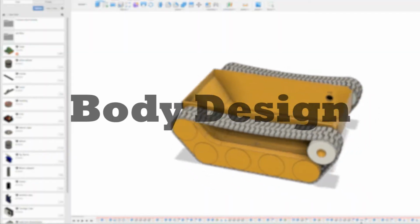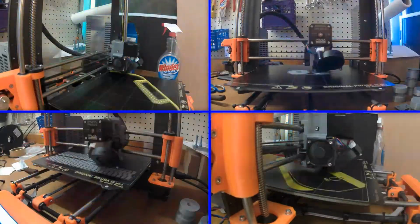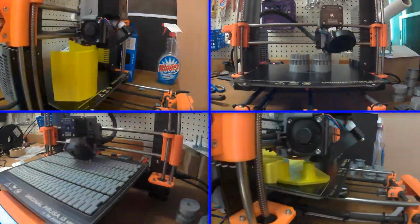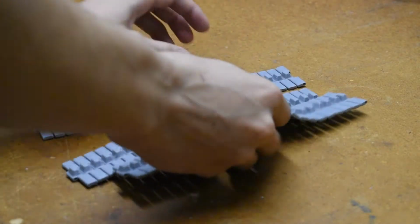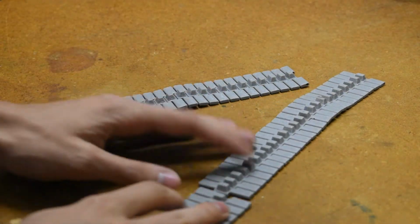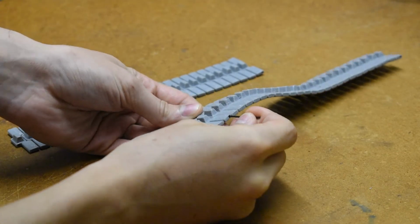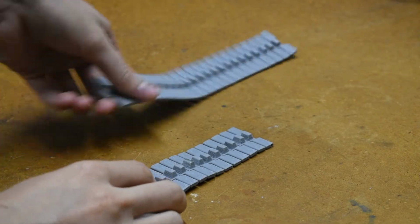Now that the software was working, we're also going to skip over the many iterations of wheels and tracks that were required to get the tank to where it is now, and start the assembly of the base of the tank. My original idea of using wheels had to change because after many tests, the wheel axles eventually all broke because of the constant stress of a load being applied perpendicular to the structurally weak plane, causing the layers to break apart. This is because of how the axles were 3D printed and several other factors.